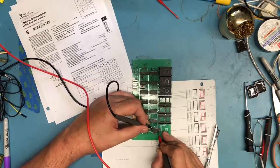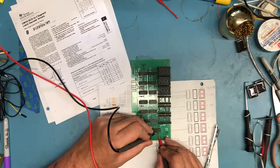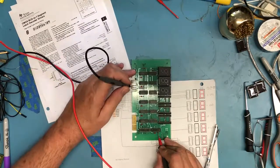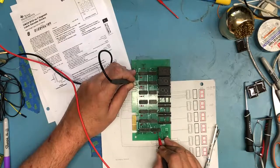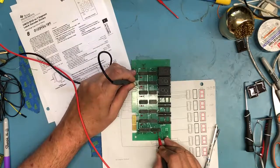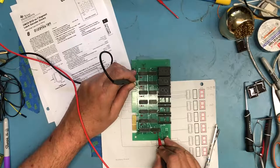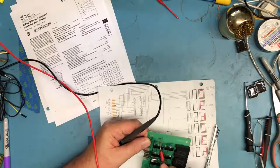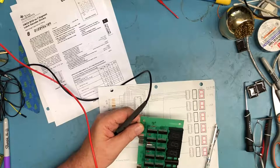And this is going to get interesting. That pin's not tied. Is there a resistor pull up? Get to the plus 5 rail over here. 653.2 ohms to VCC. That's a 10k ohm resistor, so that's not a resistor pull up there.